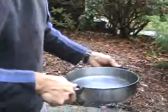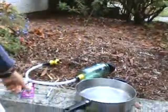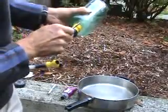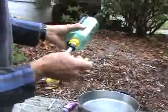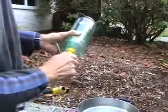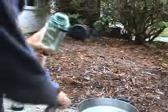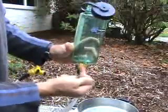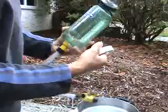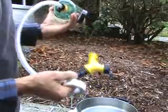The other thing we'll need is a pan filled with a couple inches of water — a large frying pan will do quite nicely — and some household goop. What I did was drill the top of this bottle with the 5/8 inch drill, heated it with a heat gun, and jammed the barb in when it was hot. That created a nice seal, and then from the inside I used a long device to put goop around the inside to create an airtight seal. You might also need some masking tape or double-sided foam tape to create the transition zones if your fittings don't fit perfectly.